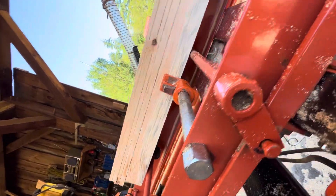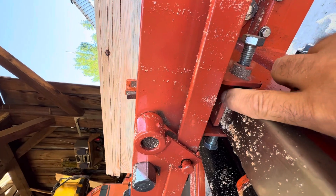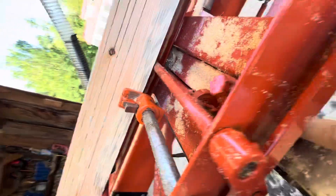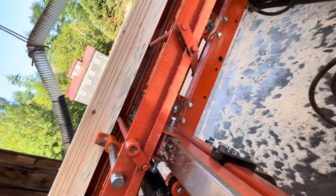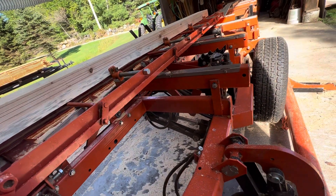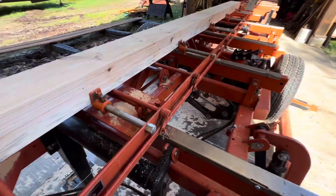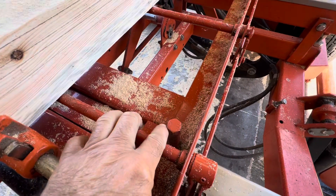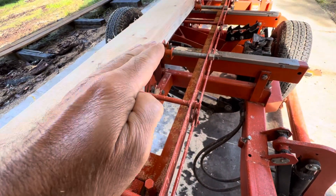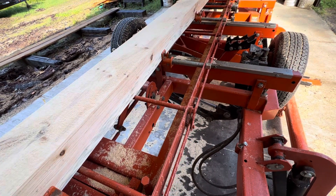Or you can do what I've done: drop it down and just have the screw head touching off on this. Then set it up the same on the other end. That way you know it's lifting up the same and setting down the same. If you don't have these adjustment screws at the same height, you're going to get a twisted clapboard when you saw. So that's something you want to set up.